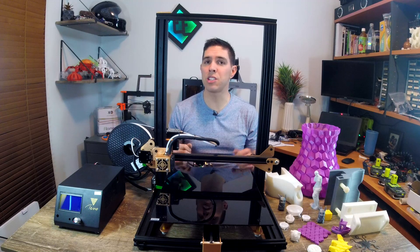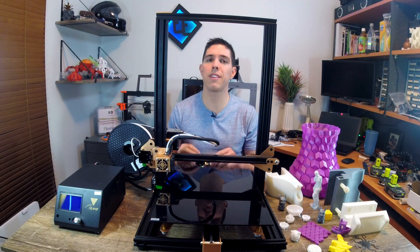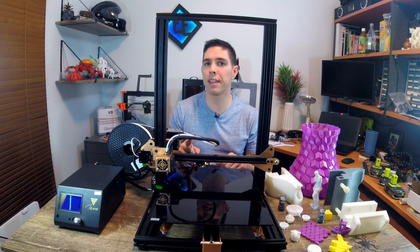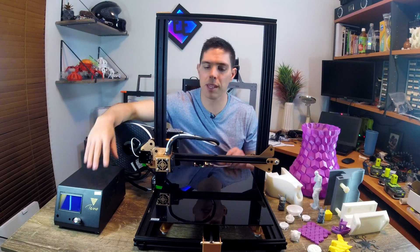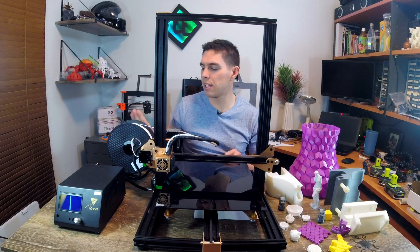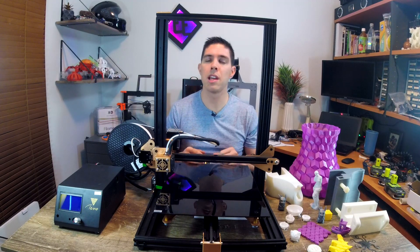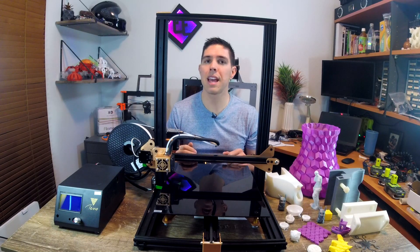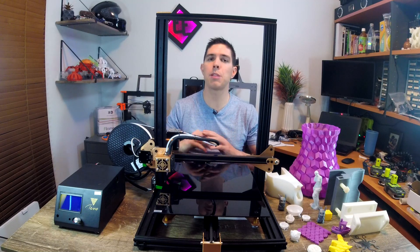Overall I really really enjoyed this printer. It looks nice and I can see so much potential with it. It's not perfect, but for the price the things I'm unhappy with are things that can be fixed fairly easily - it's a nice basis for building a really nice printer. I'm going to be adding auto bed leveling, and my big plan is to move everything from the separate control box into the space underneath the printer to make it a neat all-in-one unit, which will also tidy up the cabling. I'll also be converting it to a 0.8mm nozzle to print really big things quickly - I think that's the best way to use a printer like this, though it's quite capable with the 0.4mm nozzle that comes with it.